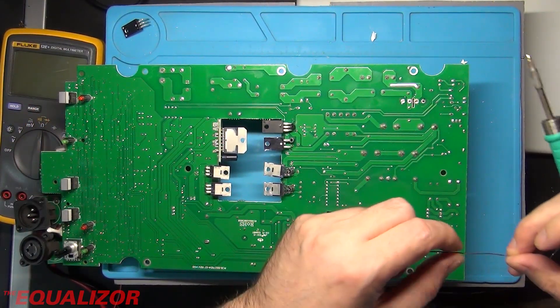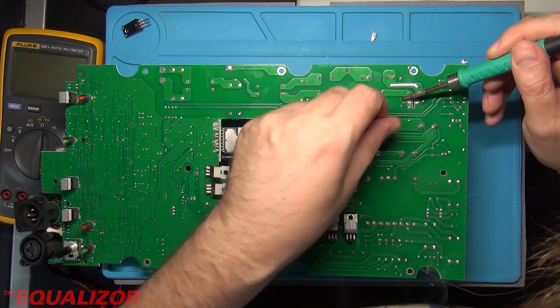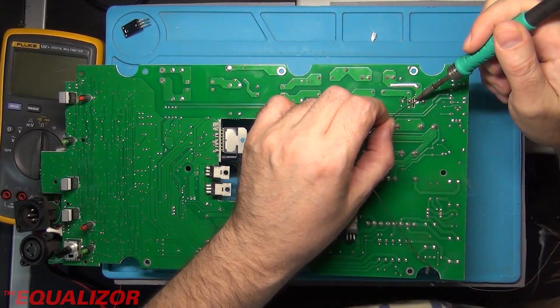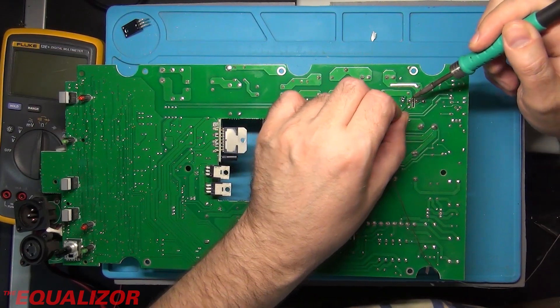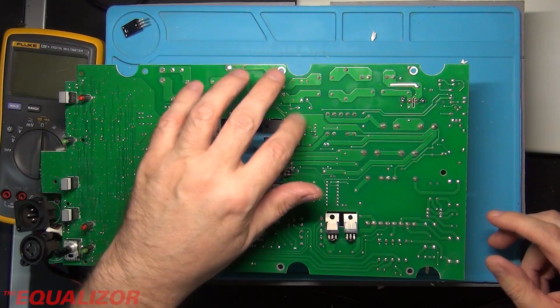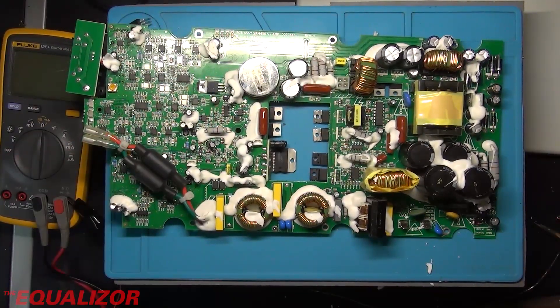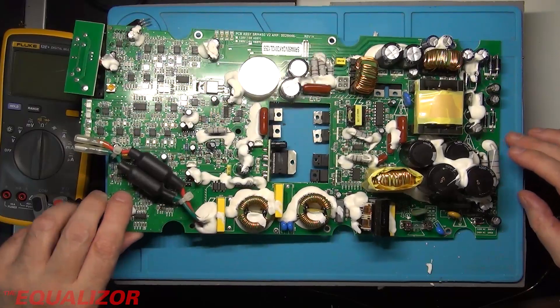The much maligned bridge rectifier. This amplifier is from their £400 PA speakers, so they ain't cheap. These take a lot of heat — I can really feel it sucking the heat out of the iron. Let me get a fuse and put it in there, and I'm going to measure the resistance to make sure there's no short across there anymore.